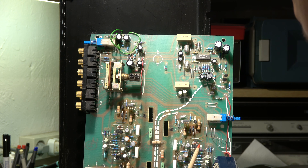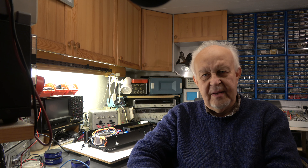The next test will be to feed a signal into the cinch connectors on the rear - CD, tuner, phono input - and use a scope to see what's going on in the amplifier. Now we are at the end of part two. In part three we will check the output and make power and distortion measurements. I found that the volume pot makes some trouble - the volume setting uses a non-standard circuit, not the typical grounded pot with a wiper. That circuit may also be causing trouble. Still challenging, this amplifier. Stay healthy, stay tuned, see you on this channel.